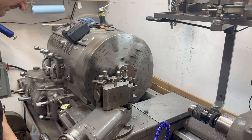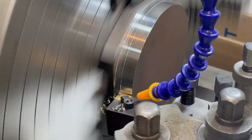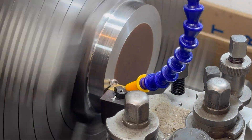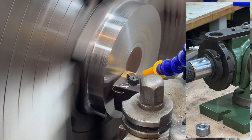In order to sharpen the reamer, I need a way to correctly index the 10 flutes for sharpening. I have an air bearing that is used for sharpening end mills — I think I can make that work. So I'm going to start by making a new index plate for it that has 10 indexes. The one it currently has has 12.